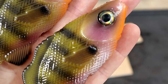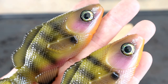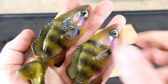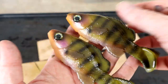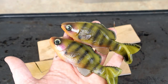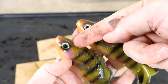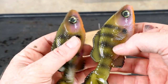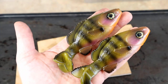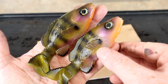Here are a few close-up glamour shots. I'm digging it. You can kind of see that little line — that's actually a cold crack line. A bait that's this big can get cold cracks with injection, so again it's probably a good idea to preheat this mold a little bit. You can see a few there but that's extreme nitpicking. If I was going to do one extra step I would darken the top right in here — I think that's missing a little bit of color. But wow, I'm really happy with these — second time ever airbrushing a plastic and I think they look incredibly natural and real.